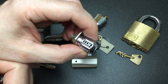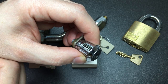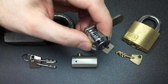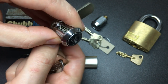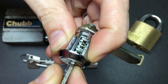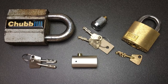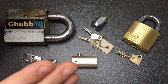It's easy, if a little misleading, to think of the mechanism of the AVA as being like a standard wafer lock rather than a disc detainer lock, something like one of the Abloy disc detainers. In a wafer lock you have a set of wafers set above and below the shear line that get pulled or pushed to the correct shear line by the correct key. The main difference between a wafer lock and the Chubb AVA is that the wafers, or sliders as the original patent describes, are not sprung.